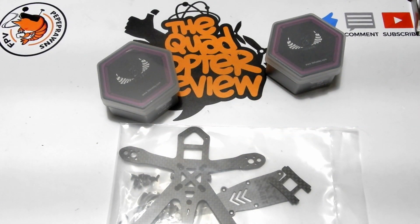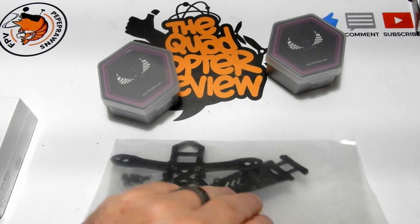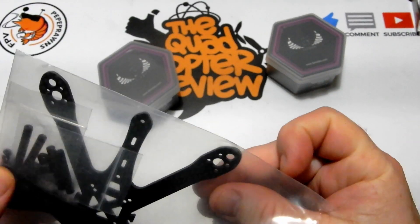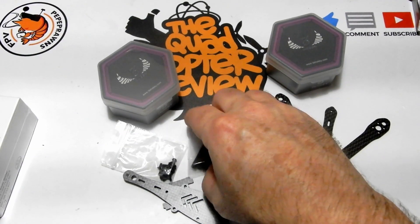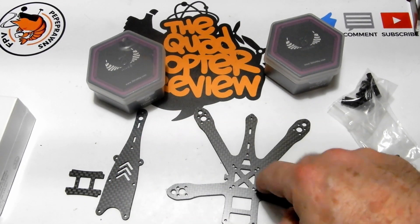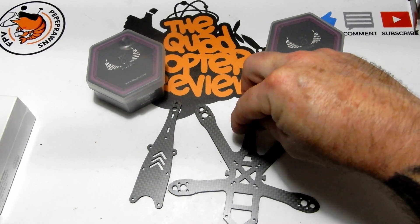What I usually start with is attaching the motors onto the frame — that's how I start most of my builds. Get them on, see what we're going to need for wiring, what needs to be snipped. They're going to be soldered on first, so we might as well get those going right away. Also, don't forget this was not your standard drone drop — it was a special mystery box drop where they give you everything you need except for a receiver.